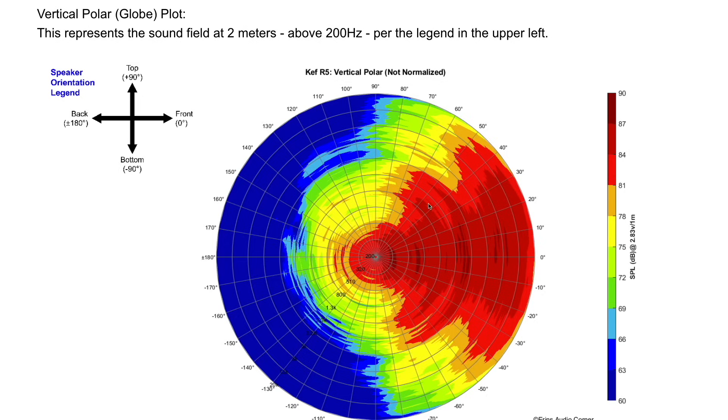In terms of the vertical response, the speaker is pretty constant around 60 degrees plus or minus maybe six degrees. But when you get to the crossover region, there's a changeover where you're not nearly as omnidirectional anymore — you're more or less beaming right through that area, right around that crossover region. Then the tweeter gets wider beyond that. So there's just a little bit of a dip in vertical dispersion through the crossover region. Whether or not that's going to be problematic, the verdict is really still out on vertical directivity and how we hear the beam width in that region — I actually had a discussion with Dr. Floyd Toole about that, and that was pretty much his takeaway too.